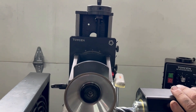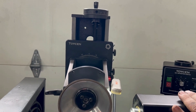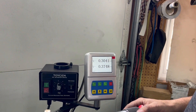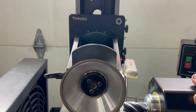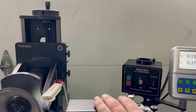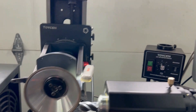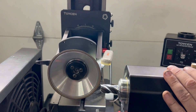Remember, flutes two and four are not 90 degrees to flutes one and three. So same process: set the display, put the wheel on center, bring the tool in, rotate to your touch, lock up the indexing collar, back away in X, back away in Y to 365, and now you're just going to plunge in about 20 thousand.